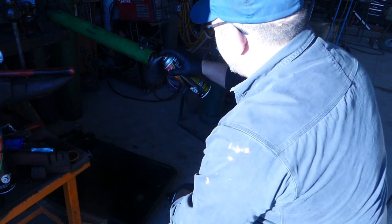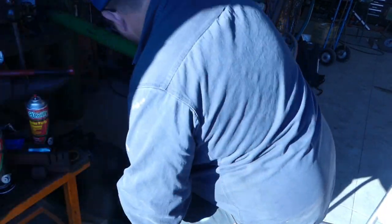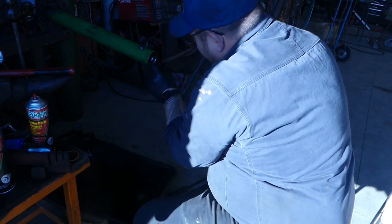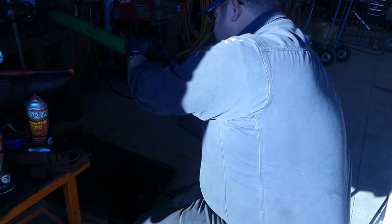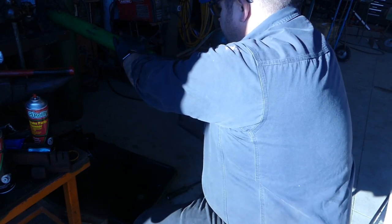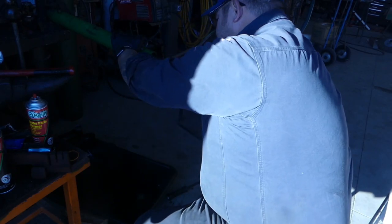We're gonna clean out our end band here. And there's that little bit of rust still in that end. Where's that piece of Scotch-Brite at? We're gonna clean up this too. That'll just help everything out and make everything slide a little smoother. We're not doing much except for this rust right here. Because rust builds rust, right?